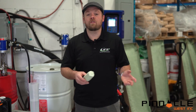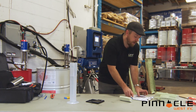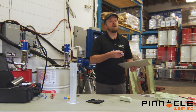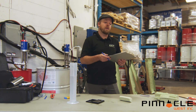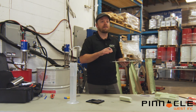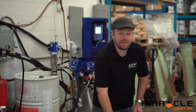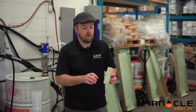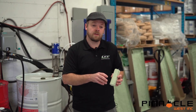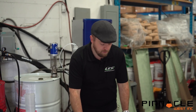Your material storage could also affect that result. Once you've determined your final density, you do need to indicate on your sheet whether it's above the minimum requirement. At 2.1 we can indicate that yes, it is above our minimum requirements. The standard doesn't specify a maximum, so you could spray all day long at 2.6 — you're going to have very strong foam, you're just not going to be making much money off it.